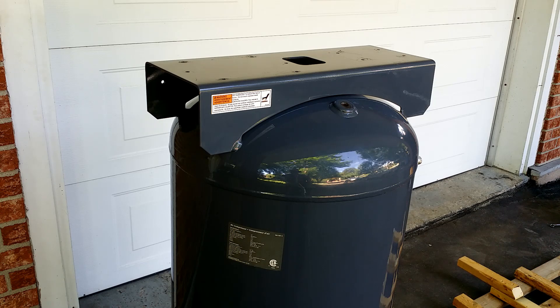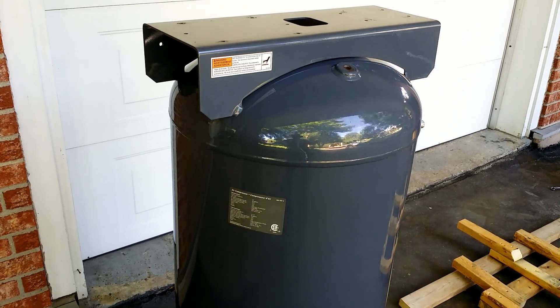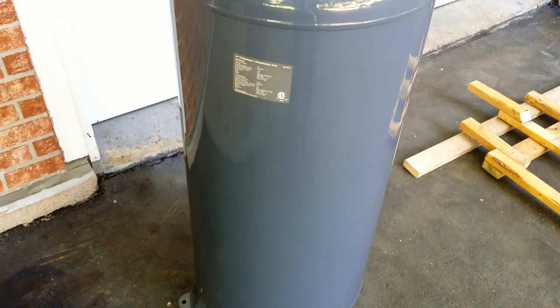I will do the hydro test on this tank. I will fill it with water and apply water under pressure to pressurize it to 150% of the working pressure. Why do I use water? Water doesn't compress as much as air. In case the vessel is to give up, I will survive — as the winner of the wet t-shirt contest — but will survive.